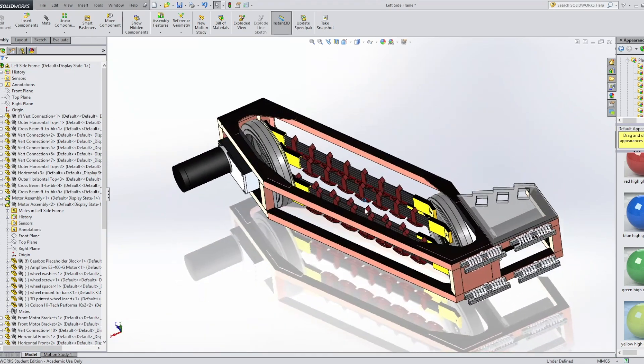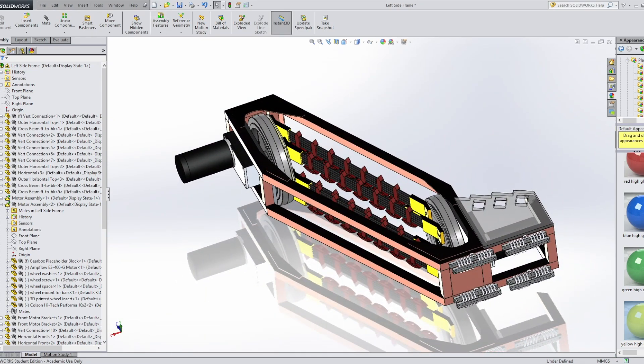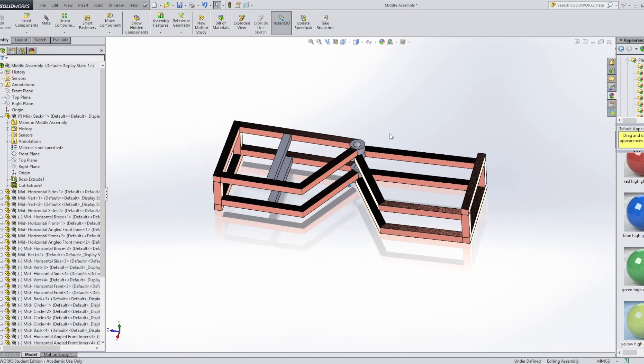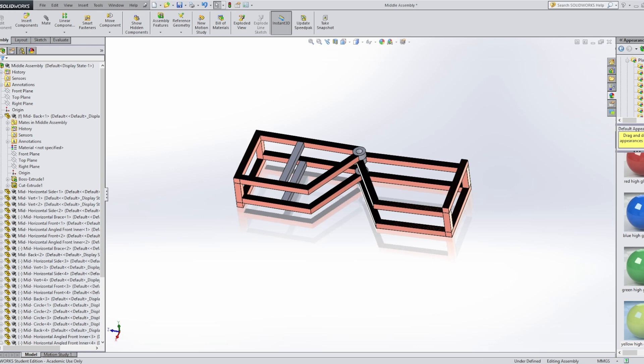So I have to find a different gearbox to use with my 10-inch wheels. That's what I did with the sides, and then I got to work on the center pivot point. I did the square steel tubing for that as well, but then looked at it and realized it's just going to get destroyed — especially because this center area might have to absorb kinetic energy weapon impacts if we grapple a robot from the front. So I need to redesign this center pivot structure with a different construction method that'll be more robust and protect the batteries and electronics, which will be in there. So yeah, that's next.